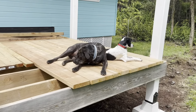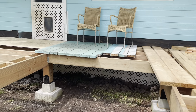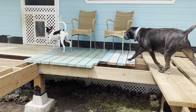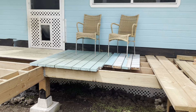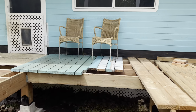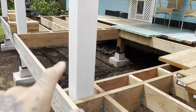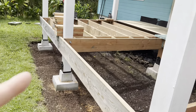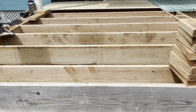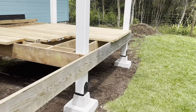The dogs are really enjoying laying out here. I cannibalized the old deck — basically took all of the pieces that were on there and put them here. Those are actually screwed down so we have a little spot to sit. This is all my material that's going to be used for the cross bracing, the rest of the joists, and also for blocking. In the middle of each of these sections, I'm going to put blocking going down, alternating on the center line, to make this super stable.